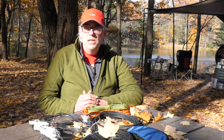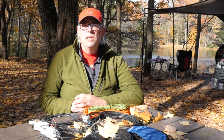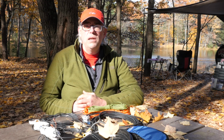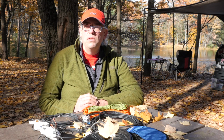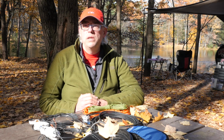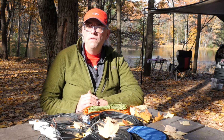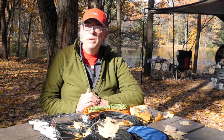Good number of contacts on the 20 meter band, and then took a couple hour break later in the afternoon, about 4 o'clock. Went back down to 40. 40 was noisy. I had an S7 noise floor here, just from the atmospheric noise and whatnot. So unless you were a 5.5 or better, I really wasn't hearing a lot of the stations. But I had good propagation.